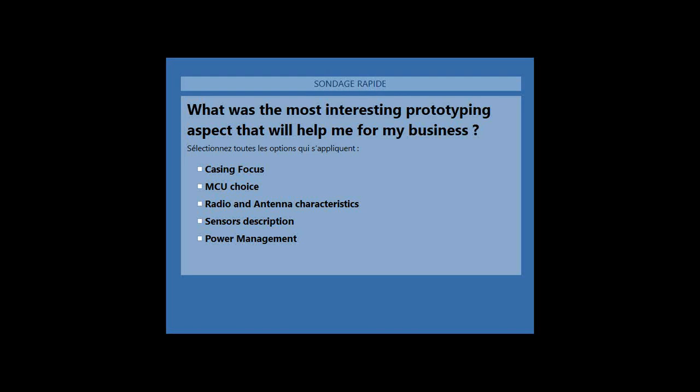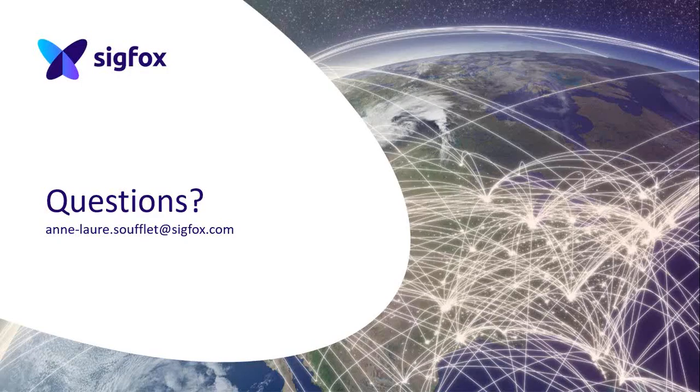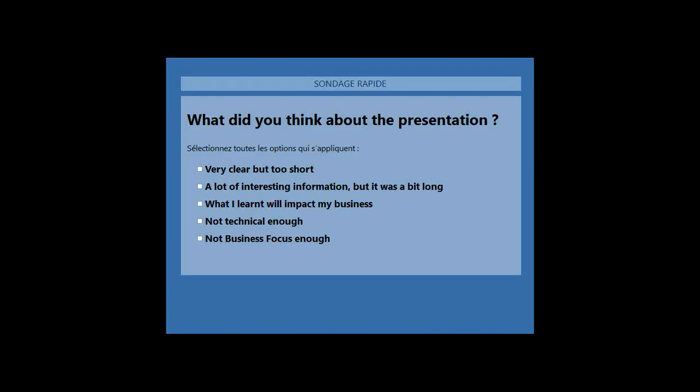How do you take that decision? Well, we chose with all of that, plus what we needed as data. So, for example, for temperature and humidity, it was easy to use because, okay, if you open it, it consumes, but there is an interrupt pin, GPIO, on the sensor. So we said, okay, we can switch it on and off when we need to. But for the lux meter, we didn't do that, and it consumes too much. So it was more a price orientation at that time, and what we wanted people to do as a usage of Sens'it. But now, with feedback and usage, I'm more clear about what I could choose.